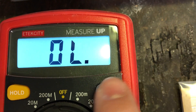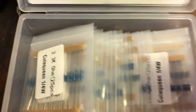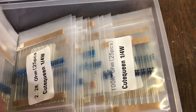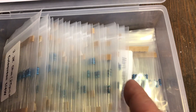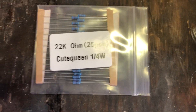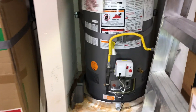After that you're good to go, and you have this really nice multimeter with a backlight, which is neat, plus a whole bunch of resistors to play with for other projects. You only need one — I chose the 22k, which is between 5,000 and 70,000 ohms — and as soon as I reset it, it was a done deal. It's been on for a little over a week now and everything's happy.